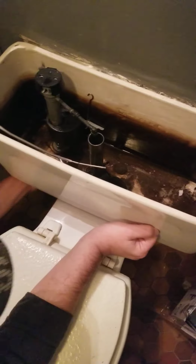You'll take a peek underneath. I'll let the cameraman get in there. That's your supply line, and underneath here, let me see if we can see it right there. Yep, is your supplies. So you simply, and believe it or not, a lot of these by hand, like this one by hand, you're just going to disconnect your water supply. There will be residual water. There always is. It will come out of there. And then once you take this off, you can take this nut off. And that's going to loosen up the valve, and then all the water will spill out and you can catch it into a bucket under here. So I'm going to go ahead and make that move right now, and I'll be right back.